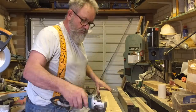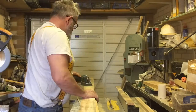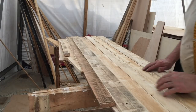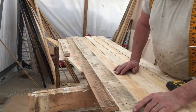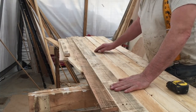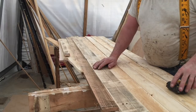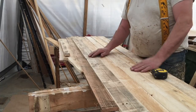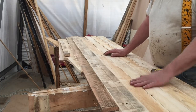Just takes a bit of grinding on these pallets. Well there we go - those boards are all laid out now. I need to stick them onto the plywood but what I'll do is paint them all first because that's how I did all the other panelling. If I glued them on now and painted them, even using the same technique, because I haven't painted them individually it would look different against the other panelling. So I need to paint all these boards individually first, then I can stick them on.